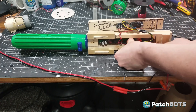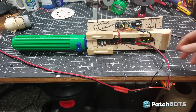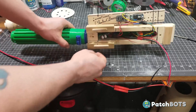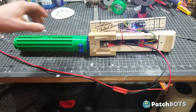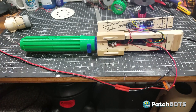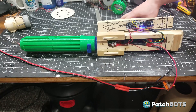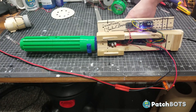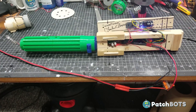After everything is mounted and wired together it's just a matter of connecting the outputs to the speaker and the transducer and we are good to go. With the power plugged in we're ready to give this thing a shot — right now I'm using a dedicated DC power supply instead of the battery just to make sure everything works. We put our power switch on, everything powers on, and now we can test our single shot and our multi-shot. Cool, everything is working, so now we can start tearing this thing down for sanding and painting and getting it ready for the final look.